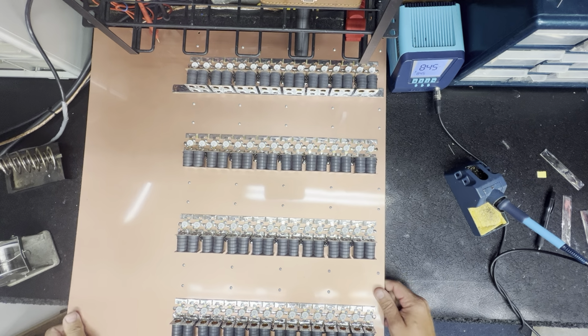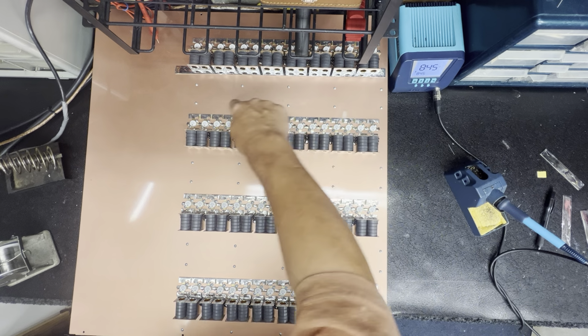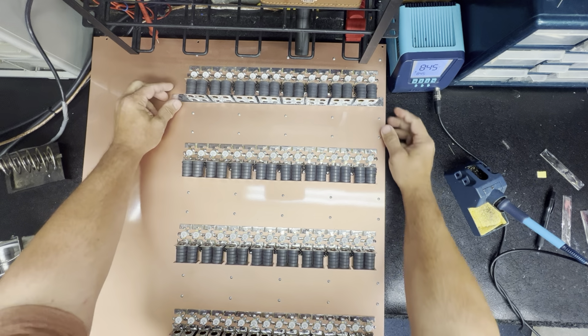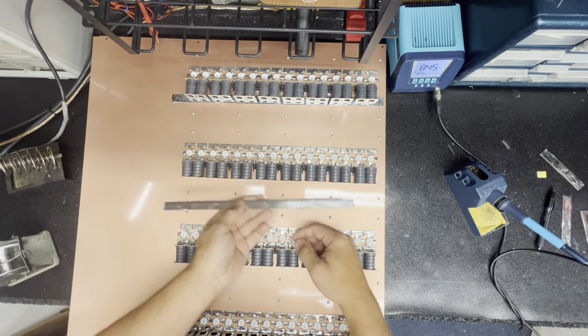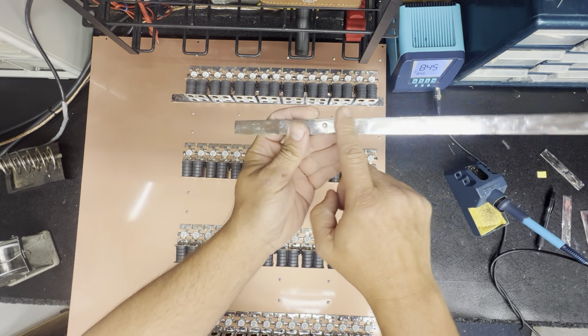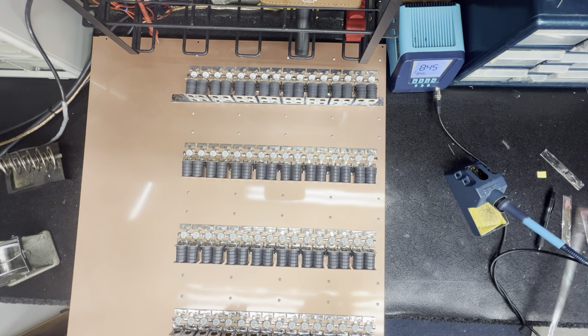I told you I'd explain what I was doing here. The reason I choose to put the hot strip underneath the transformer, there's a couple reasons why. One, if you don't and you use the wire from here to here, this is going to blow out on you. You have to put a piece of copper all the way down to keep it from failing. And number two,